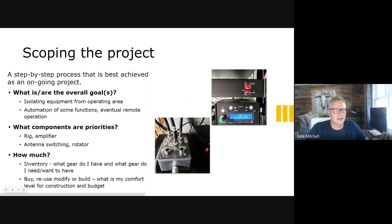One, as you notice, the 6-meter Yagi on the chimney has a rotator. That rotator was a basket case. I rebuilt that thing from scratch. It didn't have a rotor controller. A pal, VA3CW, passed along the Arduino rotor controller that you'll see in the upper right here. That and the 30-volt transformer out of an old non-compatible CDE rotor, as it drives that Ham-M, much overkill for the 3-element Yagi. But when I started this, it necessitated me walking into the other room where the equipment is located so that I can move the Yagi back and forth.